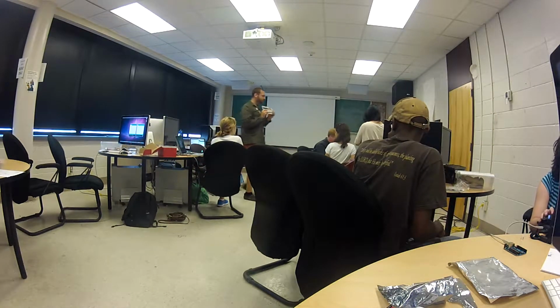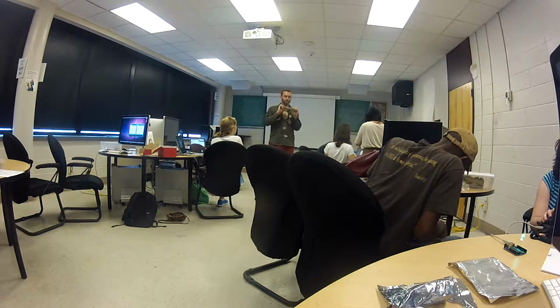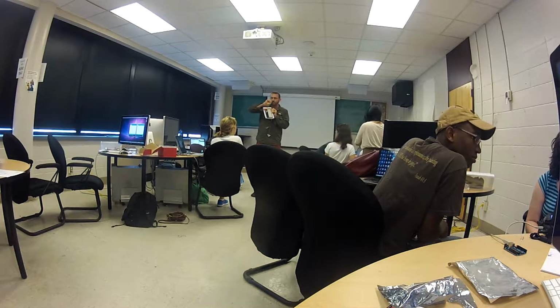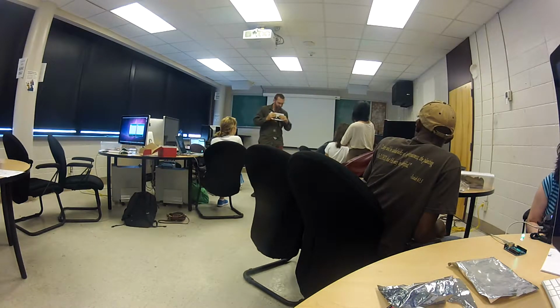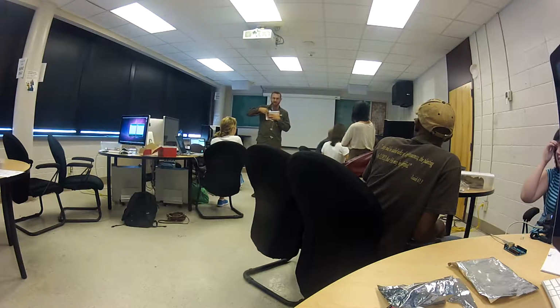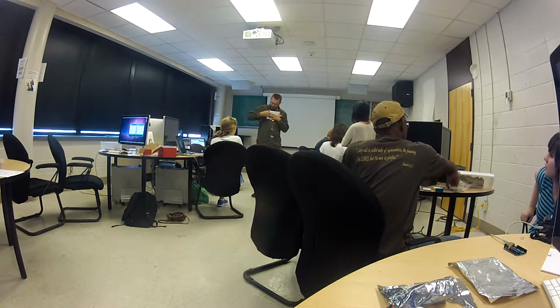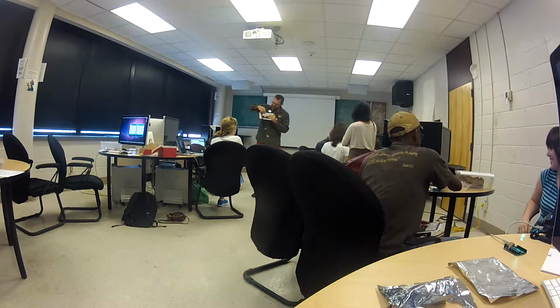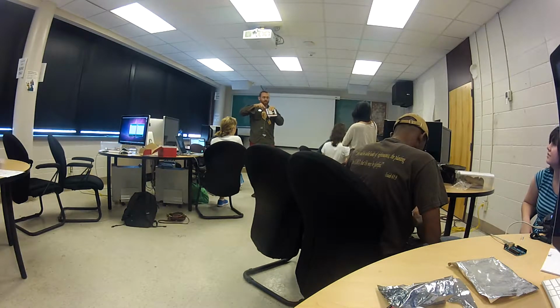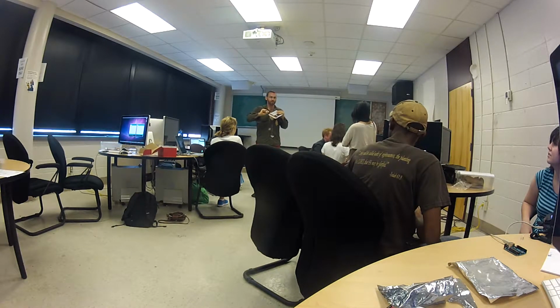Breadboards! So breadboards are super cool. The way that they work is they have lines that have wires underneath them that connect all these little pins together in a certain way. So the first sets of lines that are connected to each other are, you see where it has this big red strip and this big blue strip? That means that if you plug a wire into any of these on the left side or any of these on the right side, the wires are going to act like they're all connected to each other.